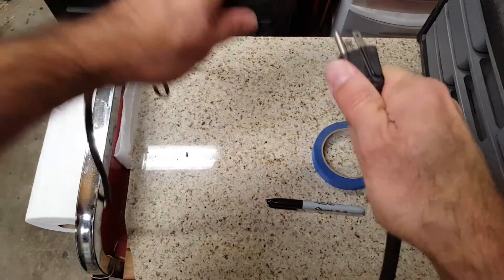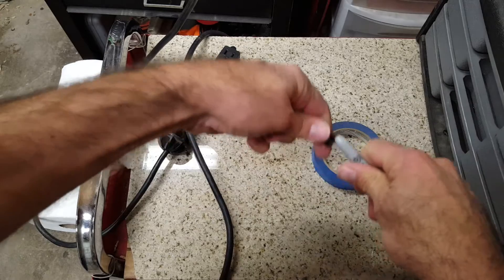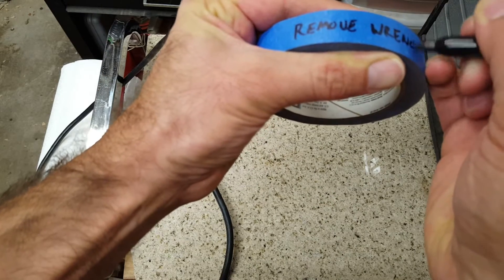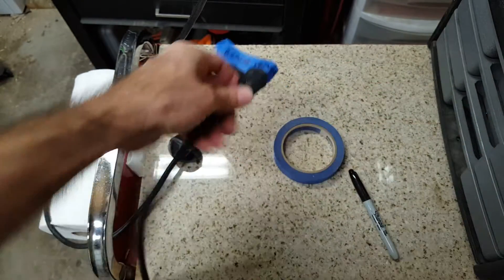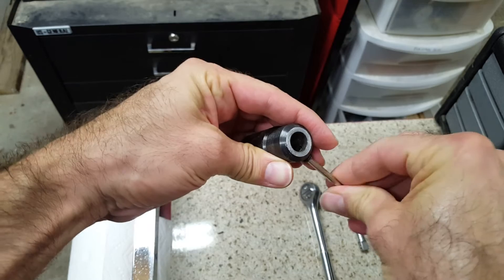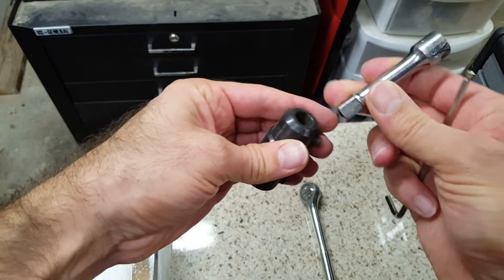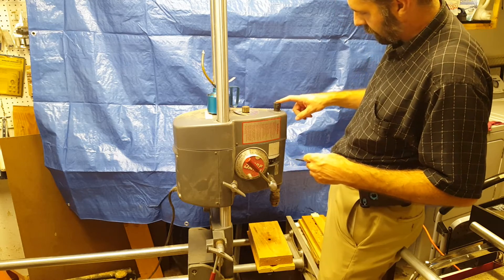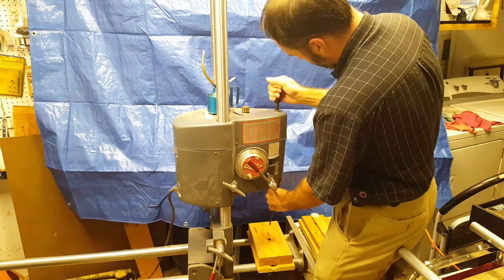After drilling, when you're ready to tap, first unplug your machine. You're going to put a wrench on the drive shaft, and you do not want to forget and turn on the motor before you remove the wrench. Trust me. I have a half-inch router bit adapter — the old Shopsmith motor is too slow for use as a router, but I can fit a 3/8-inch socket wrench extension in it. I put this on the accessory shaft, which is on top when the machine is in the drill press configuration.